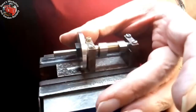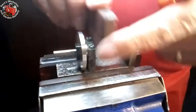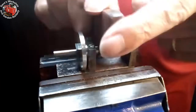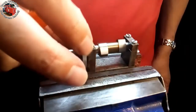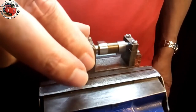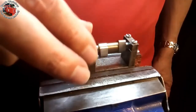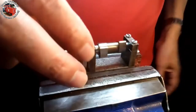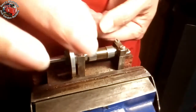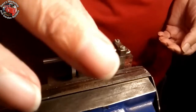The hardening of the cams went well with no noticeable distortion. I quench the cam piece in oil rather than water to cushion the shock a little, and the cams still hardened nicely. There are some now well-known errors with the Whippet castings and drawings; I will go through them as they are uncovered. I did use case hardening for other parts of the engine — it is a nice process of heating the part to red heat and dipping into a carbon-rich powder, repeating this to build up the required depth, building up a carbon-rich area on the surface of the low-carbon steel.